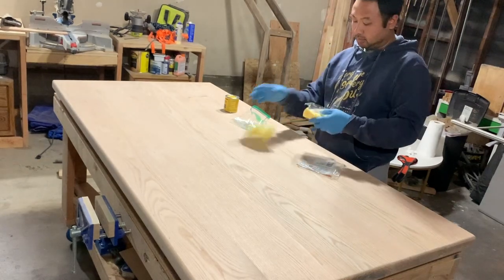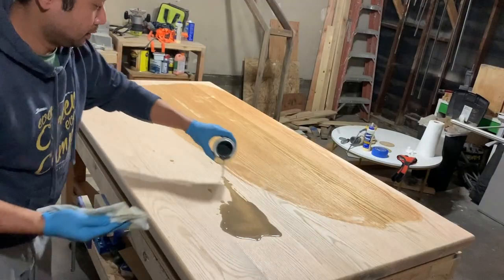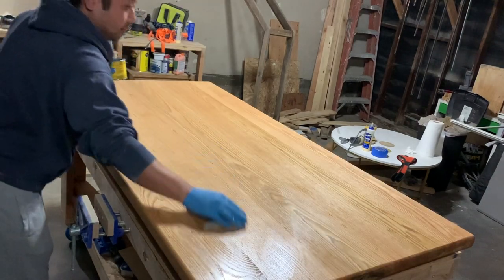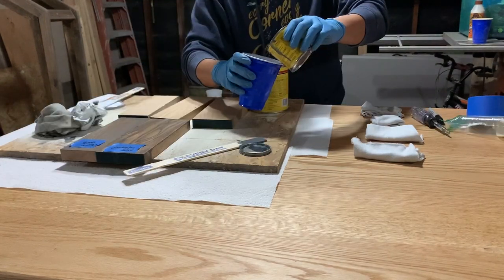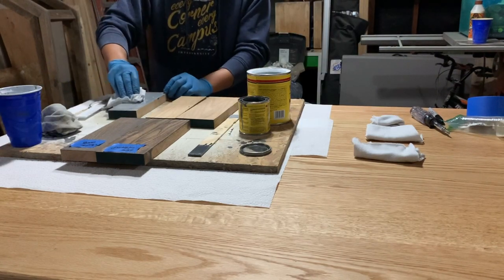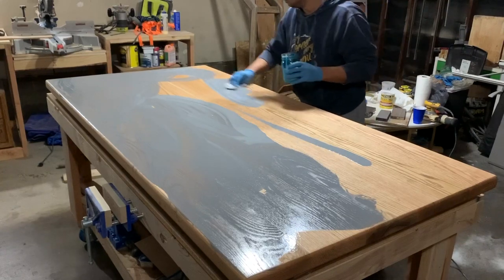Here I am applying the stain — and I made a huge mistake. This was supposed to be classic grey, but because I didn't give the can a good stir before using it, all the grey pigments were at the bottom and it came out completely natural. It actually looked really beautiful, but I wanted to make sure my friends got the color they wanted. So I went off to mix different greys and whites together until I got the right tone — what ended up working was one part Simply White mixed with one part Classic Grey. Once I got the right combo, I stirred the stain and poured it onto the table to finish staining before applying the finish coat.